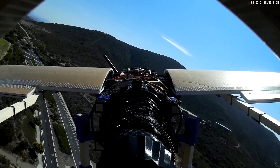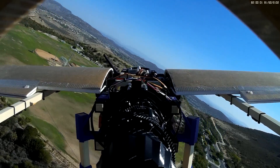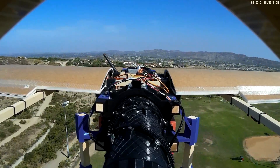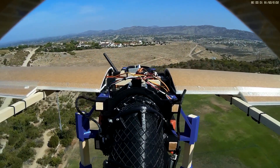Hey guys, I wanted to share an update that I made to my 3BSM design after last week's transition test flights. This is the second flight, and on the inbound transition some of you may have noticed the duct rotating a little bit out of plane and causing a left yaw kick.